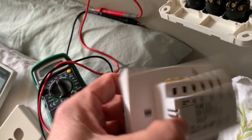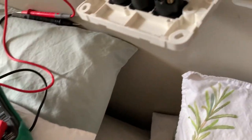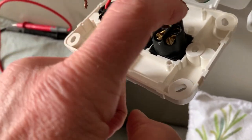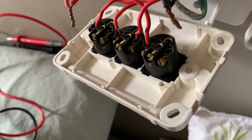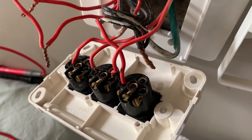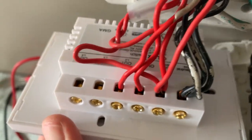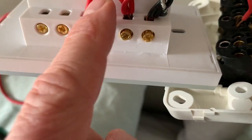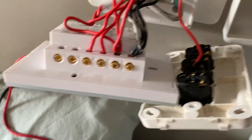it goes into the power inside on the switch there, and the neutral that was currently just terminated into one of the loops on those switches, which are basically just for holding the wires. They don't actually do anything. So that'll be the other side. Okay, so neutral goes to neutral in, power, and then the two individual switches, the halogens, are basically connected up.